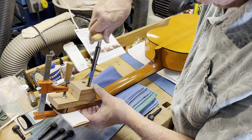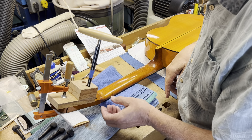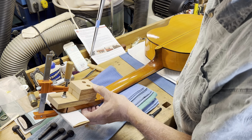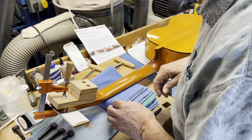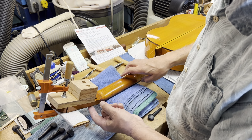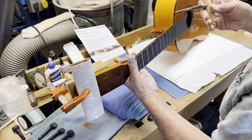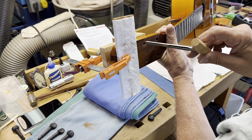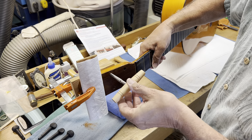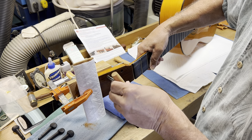I'm getting dust and chips and I'm just about starting to feel it through. I'm also checking my hole, making sure I'm centering my twist on this half-inch hole — not off to one side. Once I get all the way through and establish the 1-to-30 taper, it does get easier. I can feel the tip coming through. I'm going to back out just for a second and do a little reaming with the small reamer from the other side, to make sure I don't chip the rosewood.